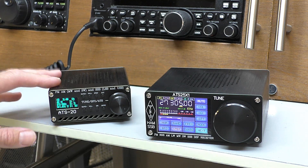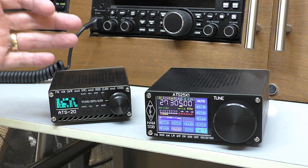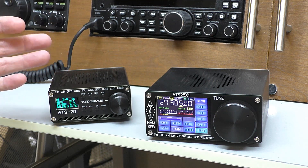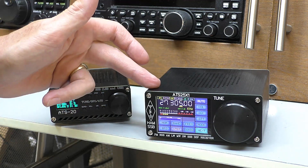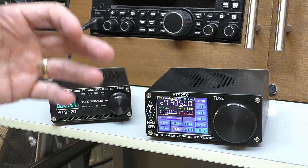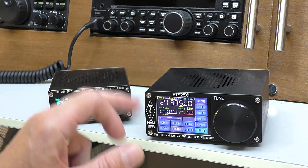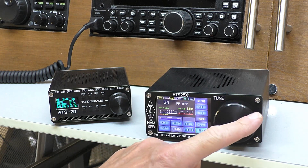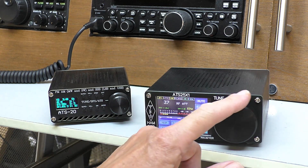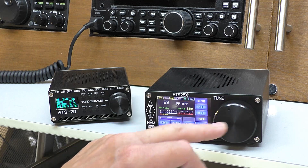What we found with the ATS20 was it had a real problem coping with stronger CB radio stations — as they came in it seemed to almost temporarily overload the radio, with a static noise that became a little bit annoying. Now although this is an Si4735-based radio with an upgraded chip, it's very similar in operation. I did notice a slight overload on some stronger shortwave stations, but what this one has that the ATS20 doesn't is an attenuator — a bit of an RF gain control — so you're able to turn down the sensitivity somewhat. It's not a full RF gain control; it goes up to 37 on the display. I found it worked on shortwave stations but I'd have liked it to be a little bit stronger.